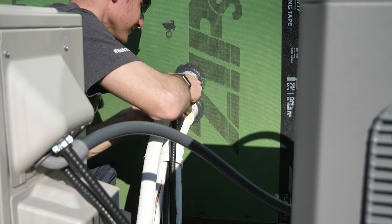To fasten the disconnect boxes, I'm using GRK two-inch cabinet screws — the perfect length to go through the three-quarter-inch Azek and into the ZIP OSB. Unfortunately I'm not behind any studs where these boxes are, so I just wanted to make sure I could grip in the OSB itself. They're coated T15 Torx head flat screws that grip a wide surface with fairly low pressure. I'm also marking the white wire here because it's not being used as a neutral — it's a hot wire. This is 10/2, so two conductors plus the ground.